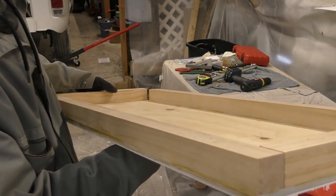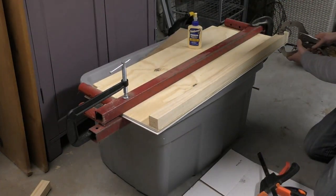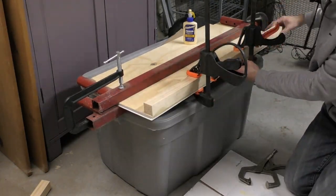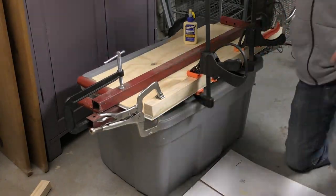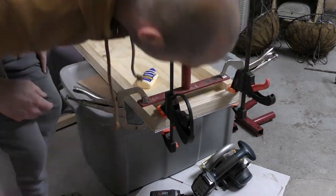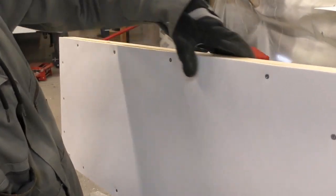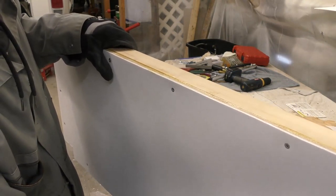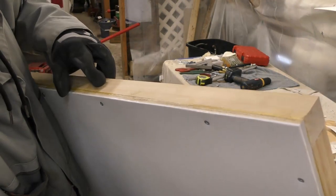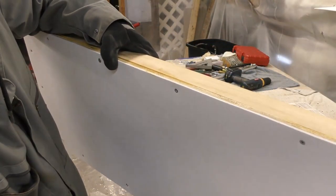The good thing about these 2x2 pine boards is they're very flat — I got the flattest one I could find. In order to straighten the board I put two tube steel pieces on each side so I could squeeze it flat and clamped them together. Then I cut these boards to size, glued and nailed from the top with two and a half inch finish nails, and let that dry. Then I screwed it from the underside with countersunk screws because contact adhesive doesn't hold wood and plastic together very well, so the screws ensure everything stays flat and hold that plastic laminate.